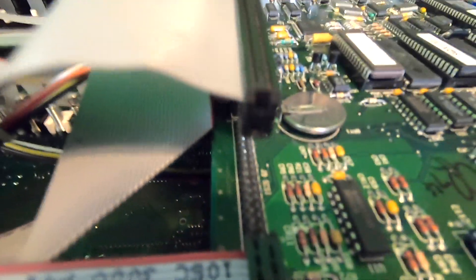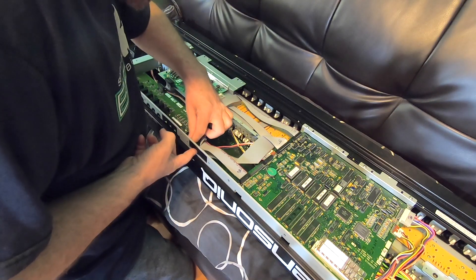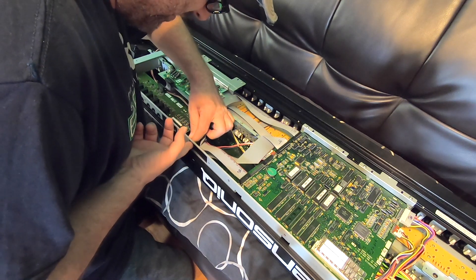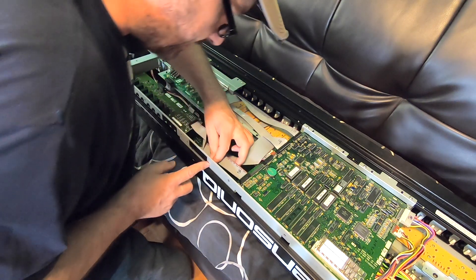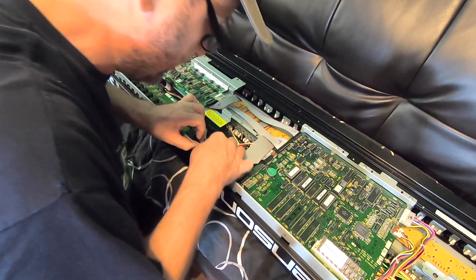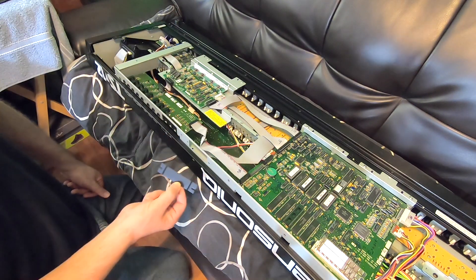Here it is under the hood. Right now there's just this metal plate here where the SCSI jack could go. The hardware is already in place that will bolt this thing in, and then it'll plug in right there. These little nuts here are a quarter inch. These nuts have a little star lock washer on them — you don't want to drop these. It looks like these studs are riveted into the chassis and the nuts and star washers will come off. This metal plate should slide off — it's basically the plate that's on the card, it just doesn't have the cutout.